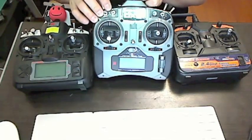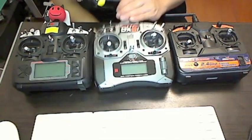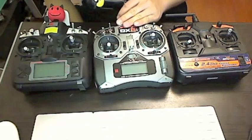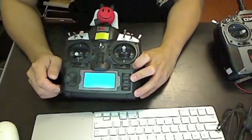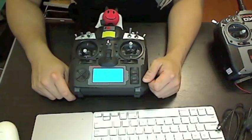For the transmitter and receiver it's just a matter of choice. I'm going to use the Spektrum DX6i. You can use pretty much any programmable transmitter, but it's preferred that it is 2.4 GHz, and it has to have at least five channels — you need channels for yaw, pitch, roll, throttle, and landing and takeoff.